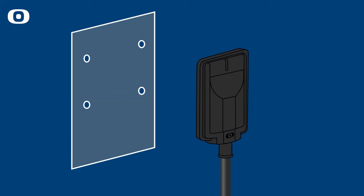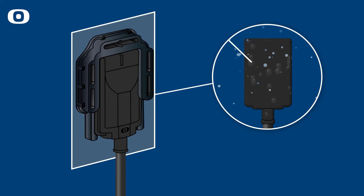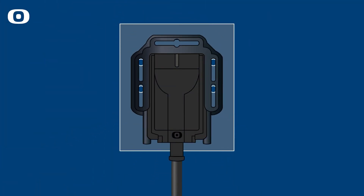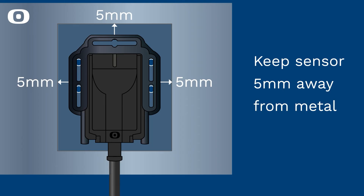The sensor with mounting clip can be used for plastic types with a minimum of moisture absorption. Fit the sensor so that it is protected from the buildup of dust and the impact of water on the detection area of the sensor, including condensation. The sensor is not side sensitive, but to avoid incorrect detection due to uncertainties in mounting, it is best to keep the sensor away from any metal components.